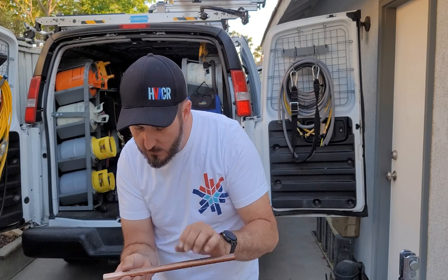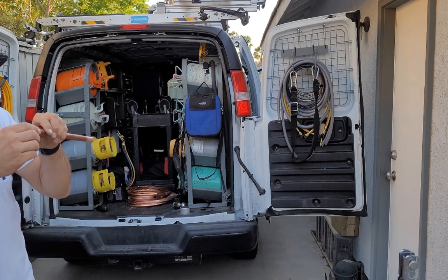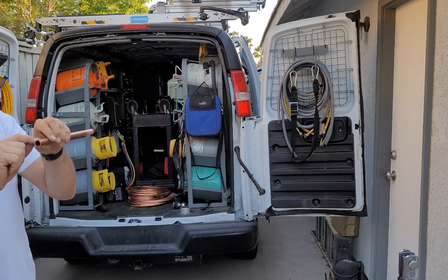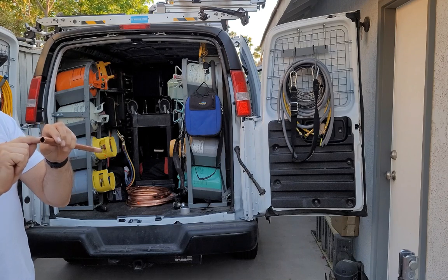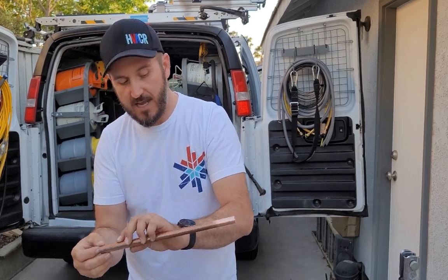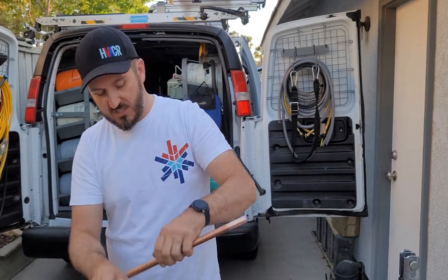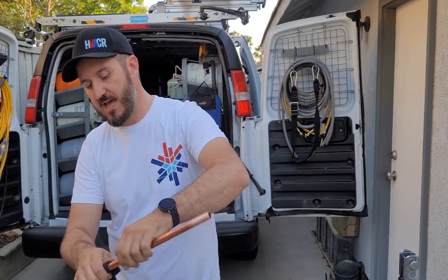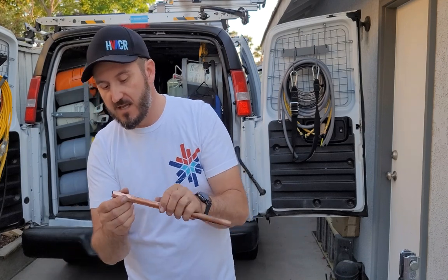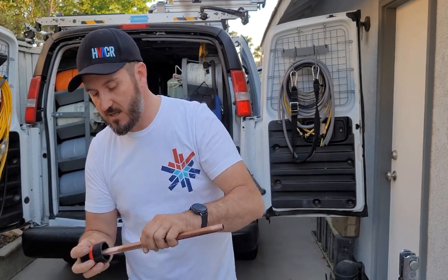What a lot of people don't realize is that on copper pipe, it's actually laser engraved — it says 'Mueller Copper' right here. That is actually a potential leak source. So if that engraving is there, you need to take some sandpaper, spin it just like with the scotch brite, and get it to where you can't feel or see the groove. Then polish it up with the abrasive pads. That laser engraving is going to cause a problem, so make sure it's not there.